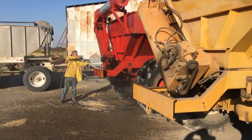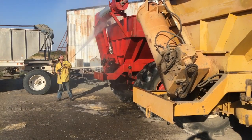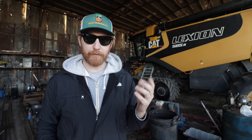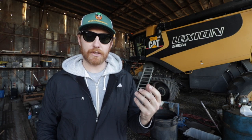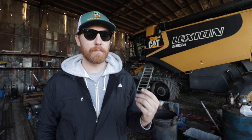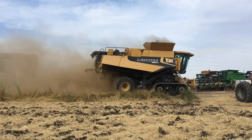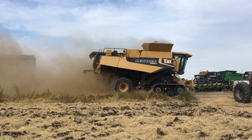The bank outs we hit straight away with the pressure washer, taking off the dirt, dust, and grime. The harvest combines, however, we blow off with an air compressor, hoping to remove as much dust, chaff, and straw before we hit it with water. These guys collect an amazing amount of dust over harvest. It really never ends. We get as much chaff and straw off the machine because once water hits it, it just sticks — never comes off.